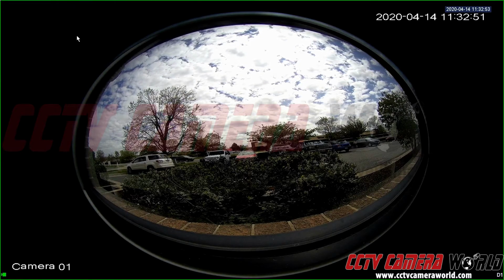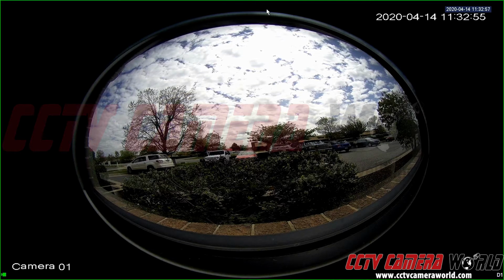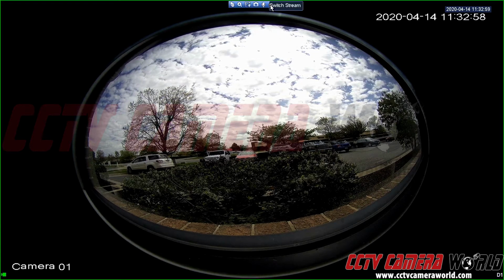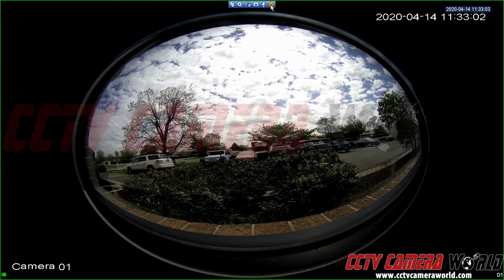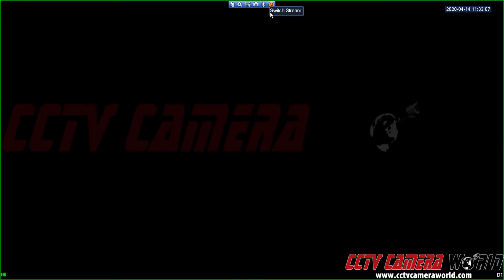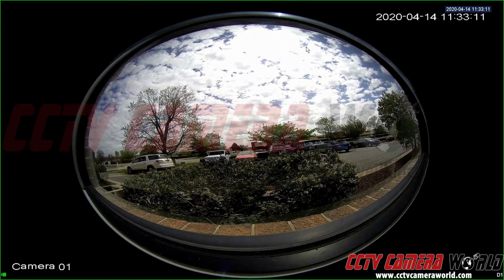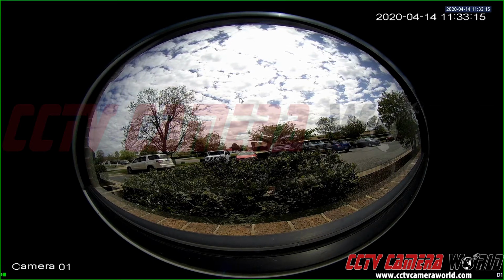But now that we've brought it into full screen, we're going to want to make sure that it's in mainstream so we get the best detail out of this. So we're going to hover up to the top of our channel here. We're going to see an M, and if you hover over it, it says switch stream. If you were to click on that, you're going to see a mainstream, a substream 1, and a substream 2. We're just going to want to make sure that we set it to the mainstream. So we'll set it back to the mainstream here. And now this will let us go ahead and dewarp our camera.